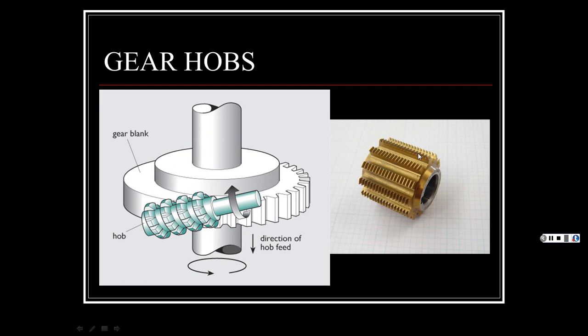And there's a gear hob right there, on its little shaft, and it's cutting all this. It progressively cuts these, spins around. This is misleading, I guess somebody just drew this. But it's cutting them all, and it just gets deeper and deeper and further down, until it cuts all the way through. You wouldn't see just some teeth and then that. That's more what you'd be doing with a regular milling machine. And you see it has all these pieces and relief in there so the chips can fly out of there and all that.